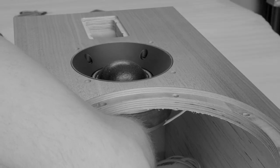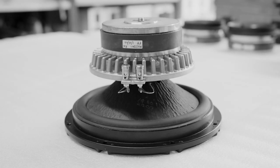It's the choice of the designer what to do with this energy, because in an ideal world that energy would sort of disappear into a black hole and never be seen again. The energy from the back is 180 degrees out of phase with the energy from the front. This is why if you have a speaker without a cabinet you don't hear any bass — those long wavelengths are wrapping around and cancelling out.